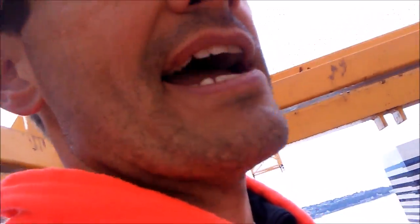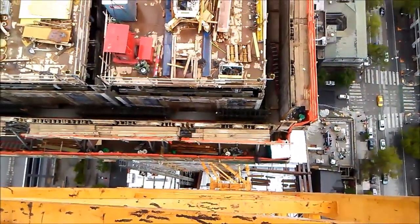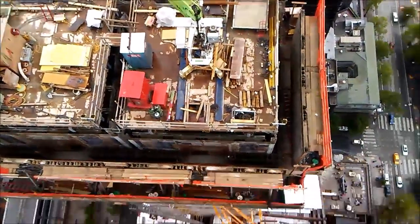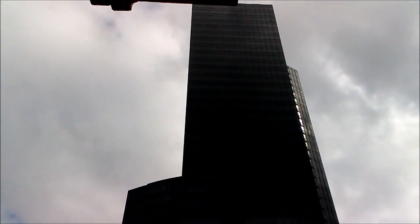That's what this is — a normal jump. You have to tie the crane into the building to do that. You can see the structure down there that we tie into: the elevator core. That stiffens up the crane and allows us to go taller. We're in Seattle — this is Columbia Tower, the tallest building in Seattle.